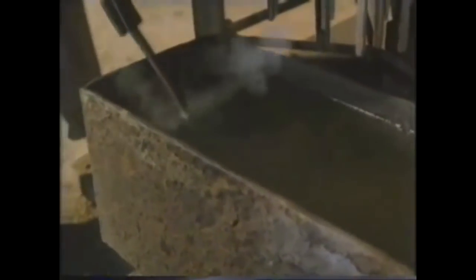To do this, the smith cleans the surface of the chisel with an abrasive paper, and then reheats it. This time to a lower temperature. Then he quenches it in water. This makes the chisel less brittle, but it also robs the metal of some of its hardness. To show you what happens, let's look at a small carbon steel rod.